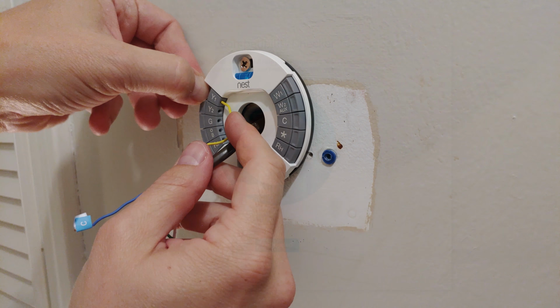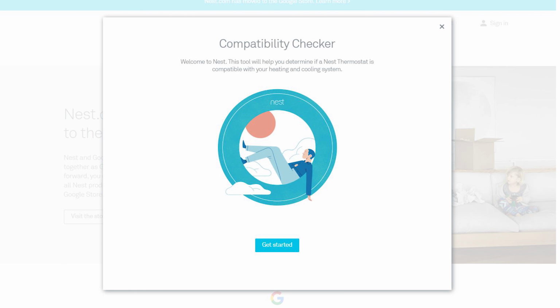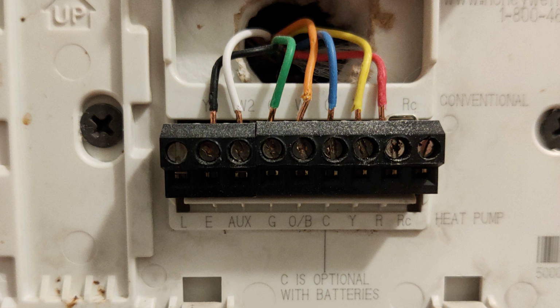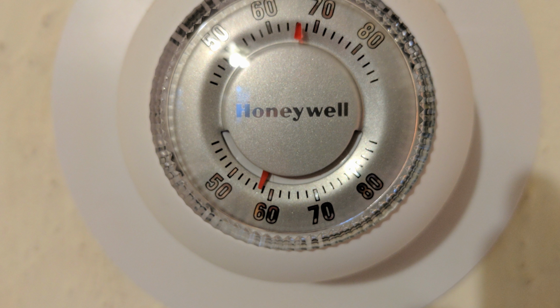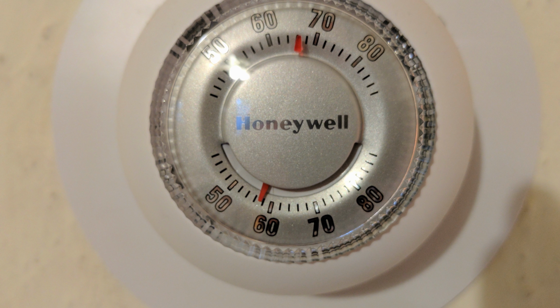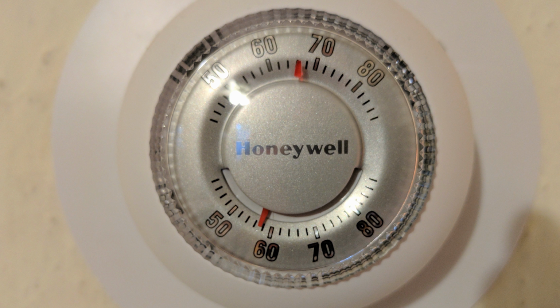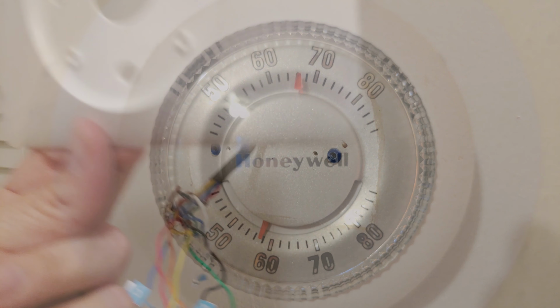No pressure. Hopefully, before you bought your Nest thermostat, you checked the compatibility tool on the Nest website. If not, follow the link below and do that before you disturb too much of the box's contents, just in case you have to return it. I had a problem in a previous rental home where the thermostat was only a two-wire system, and the Nest is likely going to require a three-wire system at the least to get things going.